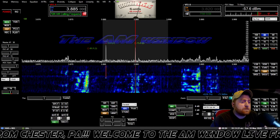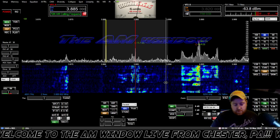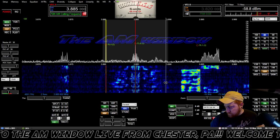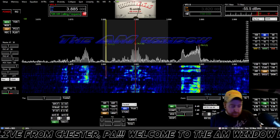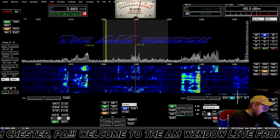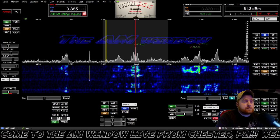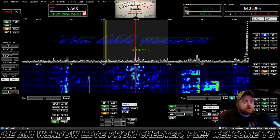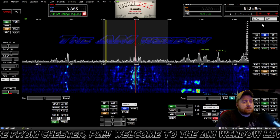Let's see. Perry asking about the amplifier. It's got the metal ceramic tubes in it. The 3CX800 has a matched pair of those. And the amplifier is a Command Technologies HF2500. They are out there, quite a few still in operation. And this thing has an unlimited key down. So at 1500 watts, no less. So, that being the case, the transformer's heavy duty enough to supply enough current to the tubes to keep them happy without drop-offs. So I can sit here and run legal limit AM on this thing all day long, you know, at right in about a 375 watt carrier, and that's just fine.